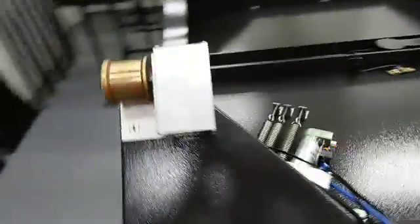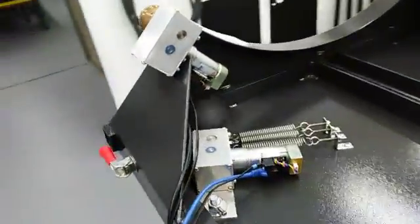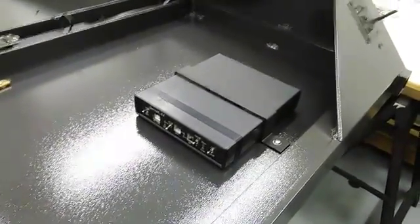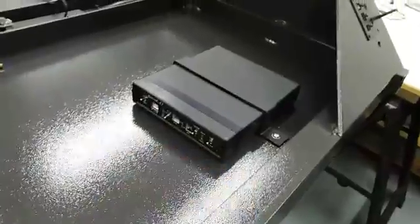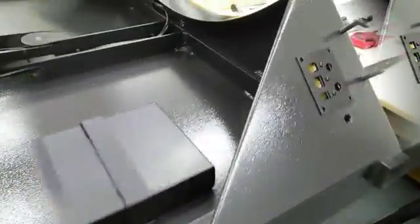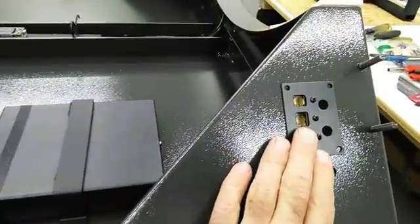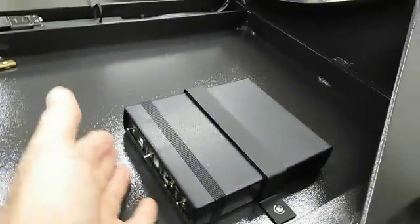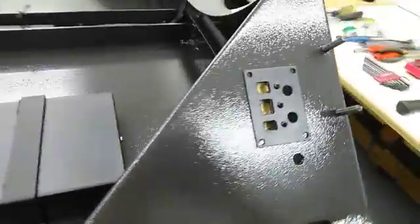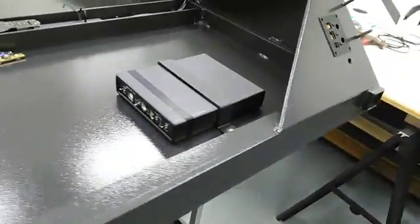I finished installing the azimuth and altitude motors. The Servo-Cat box mounts down with a strap to the floor. We make it so it's very accessible from the rear of the telescope. We also have this wiring panel on the back of the scope that brings all the wires from the front to back here. So all your plug-ins from the podium that we'll show later go right here, so you don't have to plug anything into the front of the Servo-Cat.